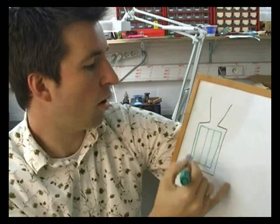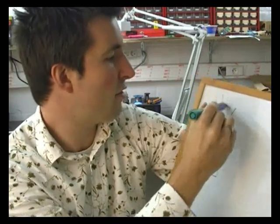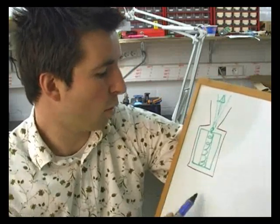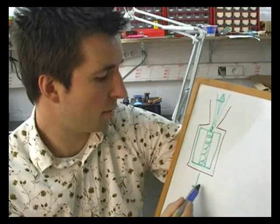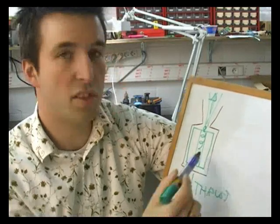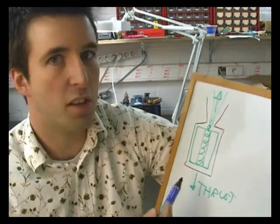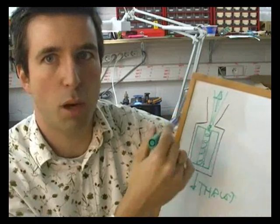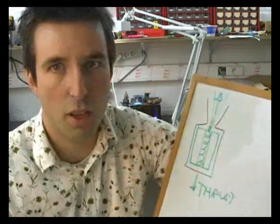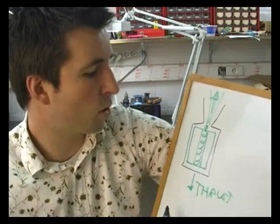When this block of fuel starts to burn, it creates a lot of hot gases which vent through the nozzle outward, creating force. The opposite reaction is thrust. This thrust depends on a lot of factors within the motor. Obviously, if we run a test blind, you'll see a lot of white smoke coming out of the nozzle, and that's it. You don't have a lot of data. So you want to measure some of the properties of the motor.